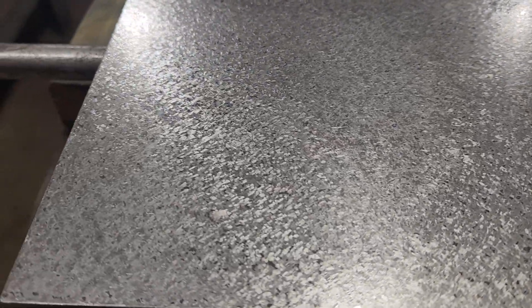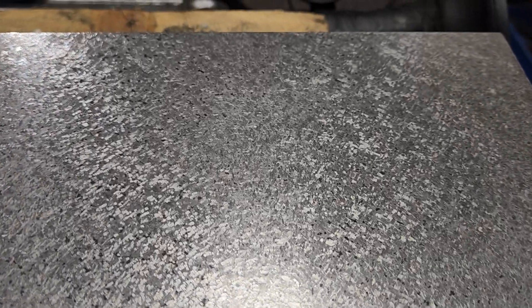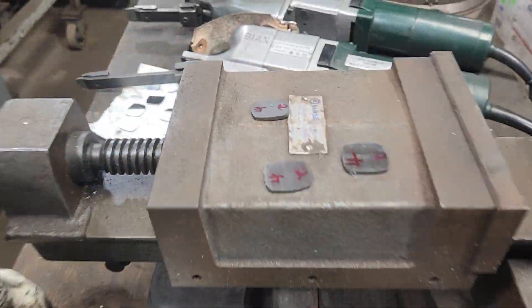I didn't pick — I didn't hold the weight of the scraper. When I scrape, my scraper touches the plate and it doesn't leave it until I'm pretty much done or the blade quits cutting. These are little tiny strokes and it's not picked. It's probably unconventional, but the scraper touches the plate and I just maneuver it around — sideways, forward, whatever — and I just hit the high spots and split them.